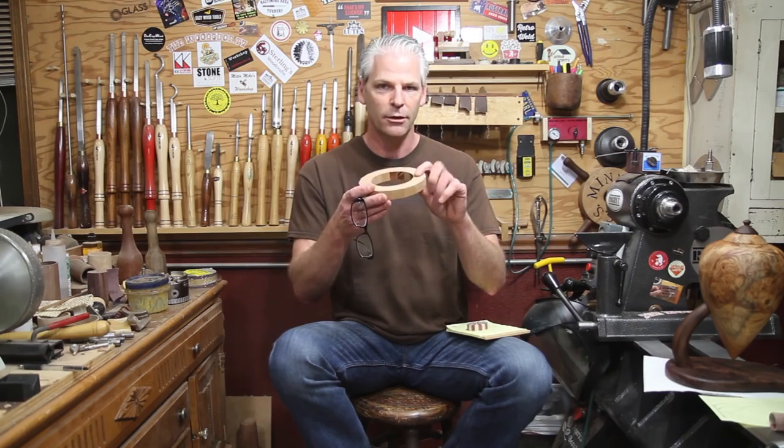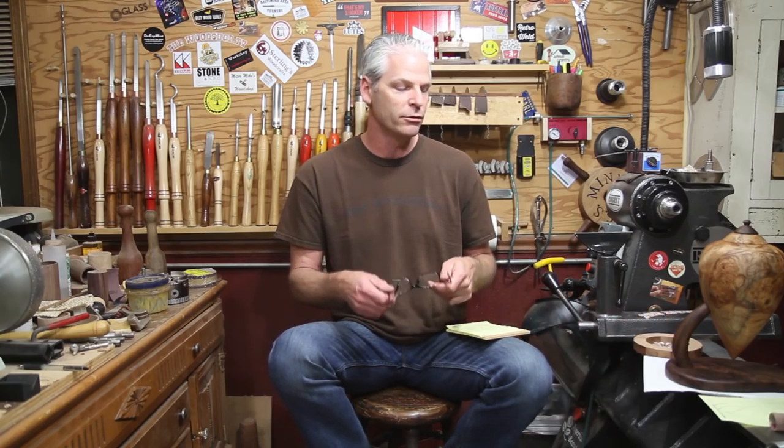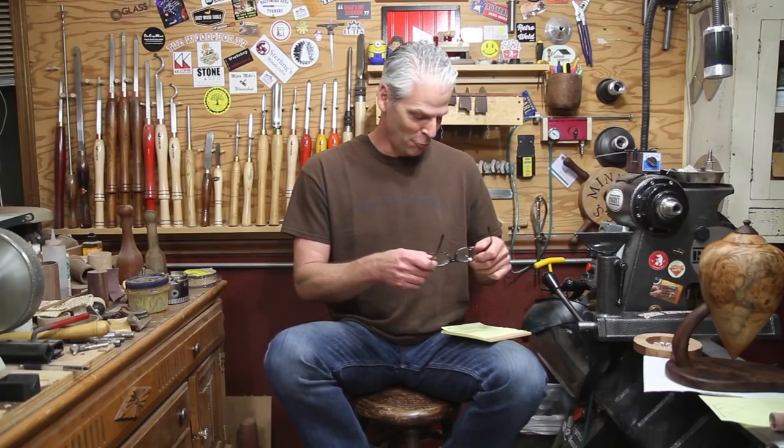When you're doing something round like that, you want that center ring. In the genie bottle it was off, but you can figure that out with that app, or you can slowly drop down on the segmented rings. For the little ones around the neck, I did a couple of test ones to figure out the size I needed. But that app will really help you out, and you won't have to do any test ones - especially if you're using the Segeasy segmenting sled.